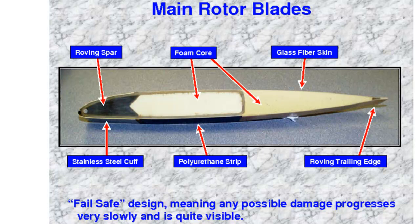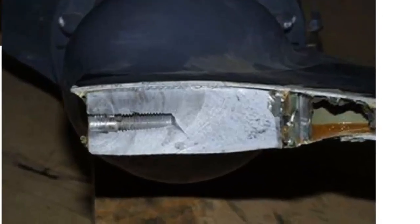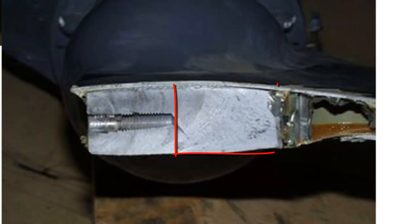It's very important that these get a thorough inspection every 100 hours. Here's an example of an R22 blade where the time life was exceeded. We typically have an hour limit on rotor blades — a total number of hours past which you cannot fly them, even if the blade still looks perfectly good. I believe the number is around 2,200 hours for an R22, and this operator flew past that. Looking inside the blade, you can see an area that's been polished, indicating the crack was progressing for some time before final failure — the sides of the crack were polishing each other smooth, and the gray area is where it finally snapped all at once.